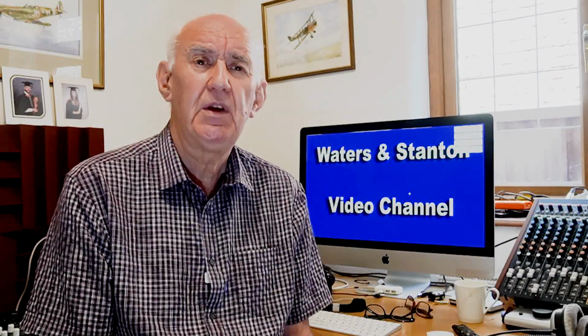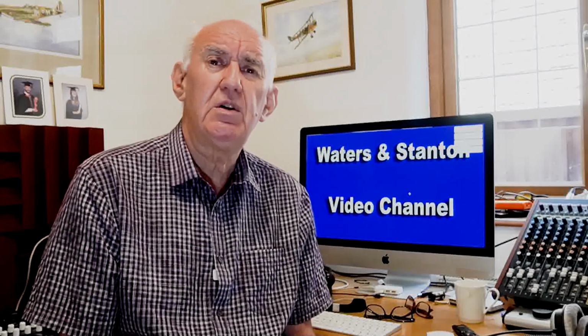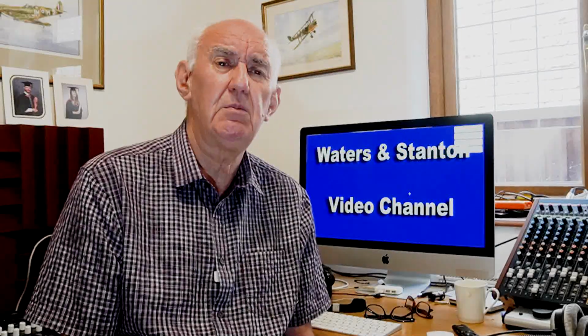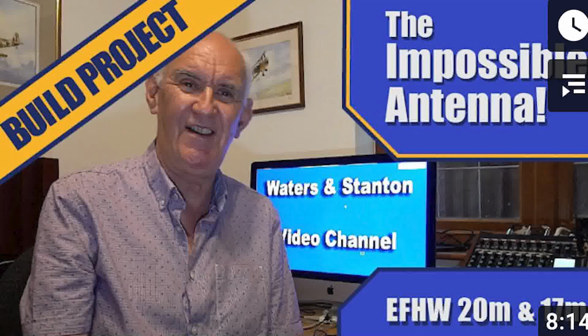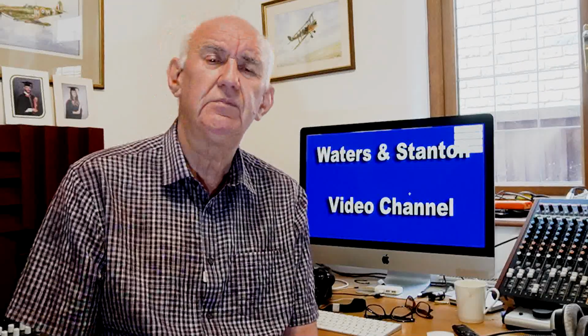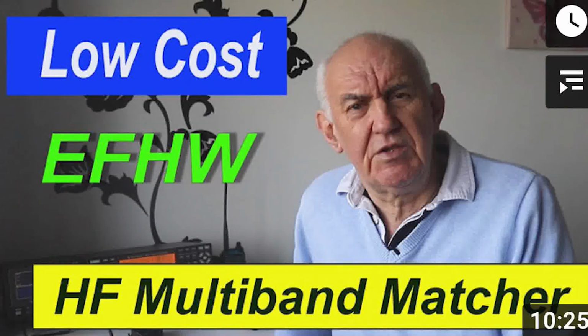My favourite happens to be the end-fed half-wave because it is a multi-band antenna and it is very easy to erect. You can throw it over a tree or whatever. I tend to use mine sometimes as an inverted V and sometimes as just a wire run out. I recently did a couple of videos, one showing a 20 metre and 17 metre end-fed wire, which is only around about 8 metres long, and I'll put a link to that video below this video. I also showed you how to make your own matching transformer. Again, I'll put a link to that as well.